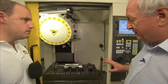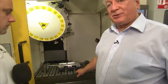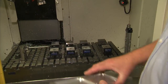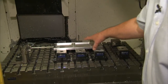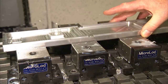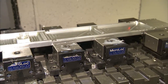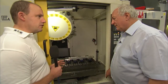They looked for systems to clamp work up quickly, and for this machine they bought into the micro lock system, which consists of a number of modular blocks that can be positioned anywhere on the grid. They can clamp short parts, or by adding more blocks, longer parts of the same family. Depending on the size of the component, different numbers of clamps can be used.